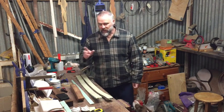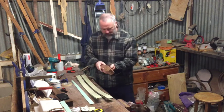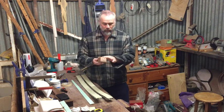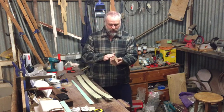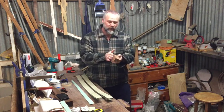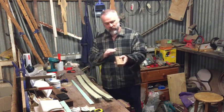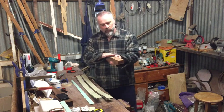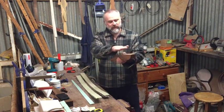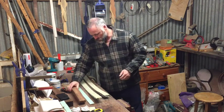I've got both my limbs done now. I've taken them out of the oven, and I've also got my riser block here. This is a nice piece of Tasmanian blackwood — lovely bit of wood with a nice grain in it. To prepare this riser block, I've planed one face dead flat, and then off that face I'll take my two limb faces, so they're perfectly square off that first face. By doing it that way, I know that when I attach my limbs those limbs are going to be perfectly flat with each other and not twisted at all.